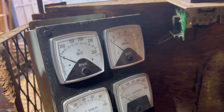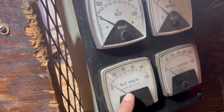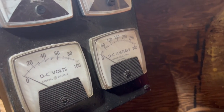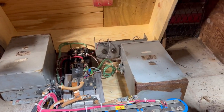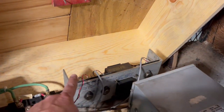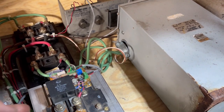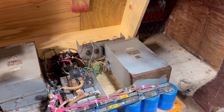I do have a little gauge panel on this one — I've got line voltage, line current, voltage of the DC bus, and also the current that the motor is drawing. On this car it's geared pretty low; I have yet to see that break 70 amps. It's all way overkill, but it'll be reliable for basically ever. There's also a 15-volt power supply that supplies power to the electronics to drive the throttle control and the power module. That's pretty much it for this car. Let's hop on over and look at the steeple cab now.